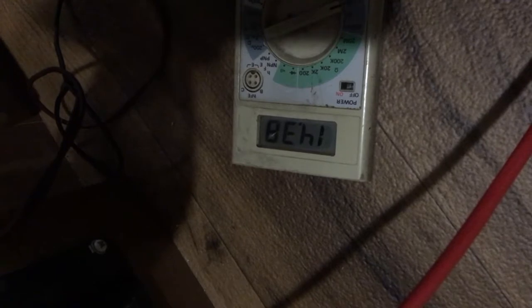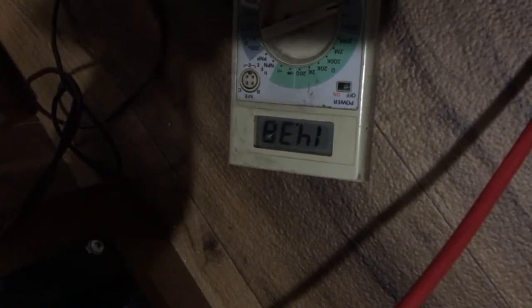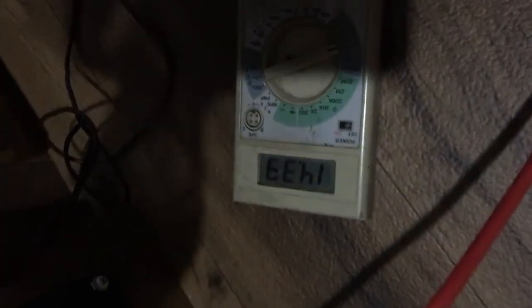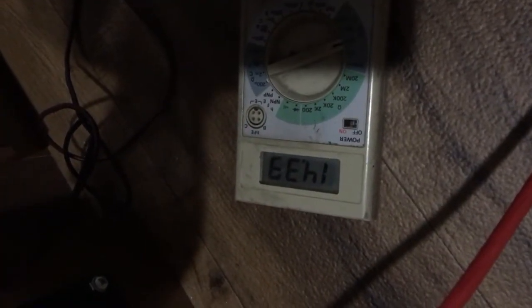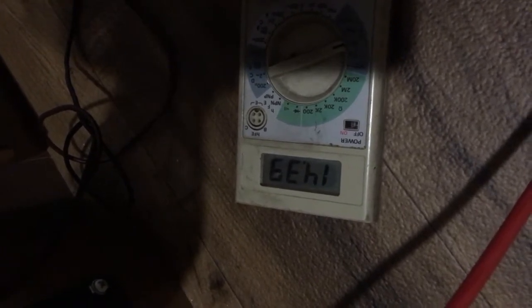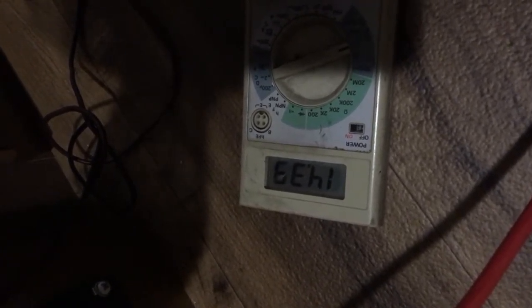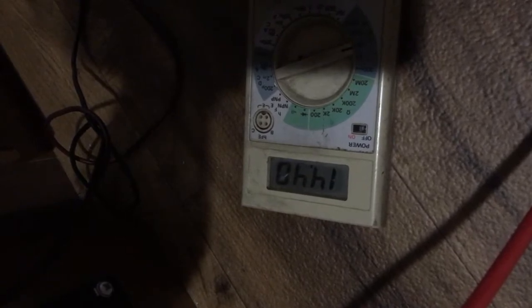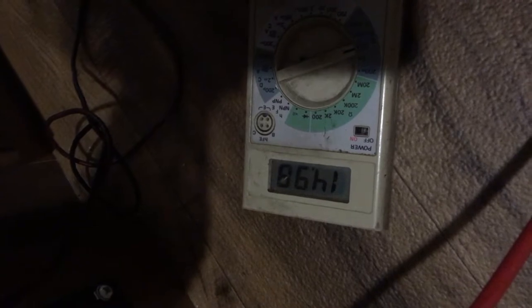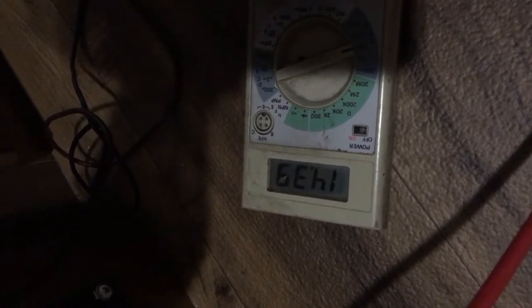It's still 64 amps out there at 35 minutes. Pretty cool — just adding that wire made a difference. I guess I could add the wire and then do more tests to see how easy it is to get into bulk mode by just throwing a little load on the batteries.